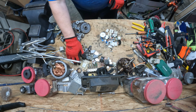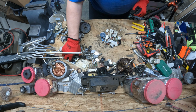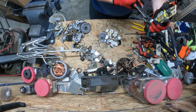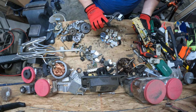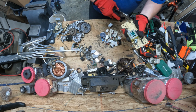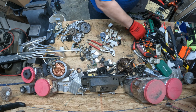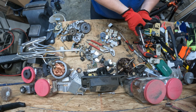or the 2 motors in the transformer, and the switches, not switches, the relays. I'm fairly sure those are all relays. Let's have one little look. White one I'm almost positive is, yep, definitely a relay. There's our silver contact. The smaller ones got a fill in there also. Chance they could be a capacitor, but I don't think so.